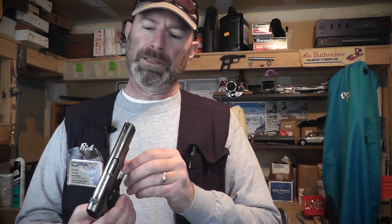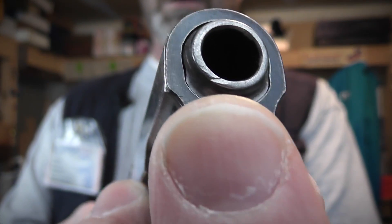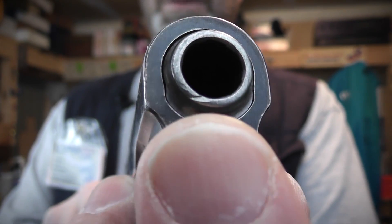Although I'd never really looked very closely, the muzzle had been damaged — it was dropped on something and that impact was near enough to the origin of the rifling that metal was actually displaced into the bore. So every time a bullet passed out of the barrel, the last thing it hit was this flat spot on the side where the dent was. That's what was causing the bullets to tumble and keyhole.